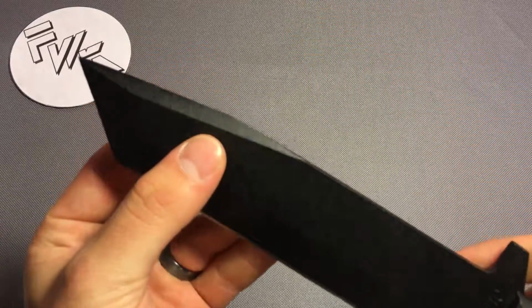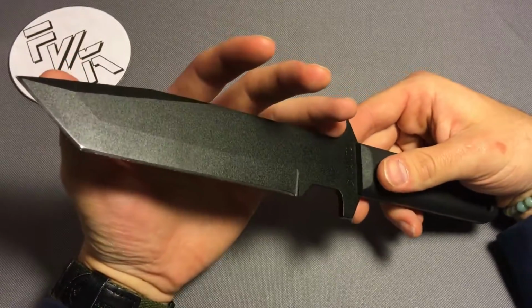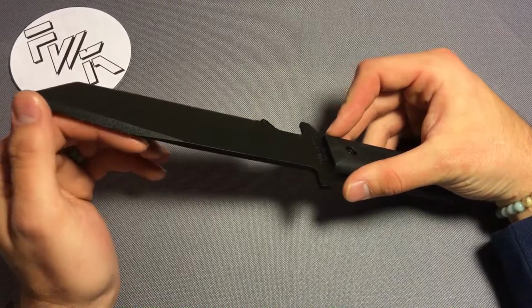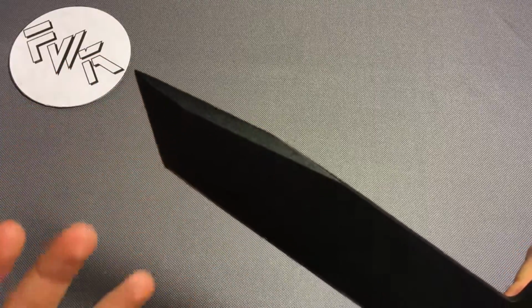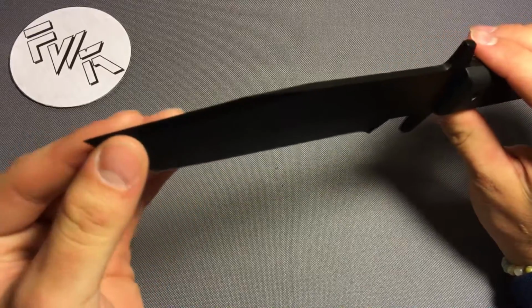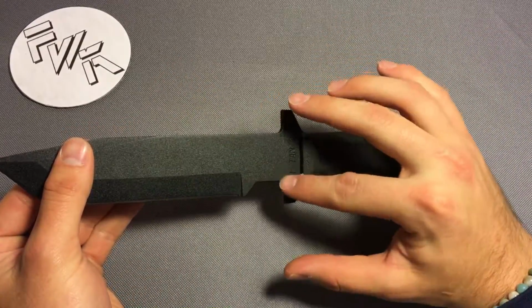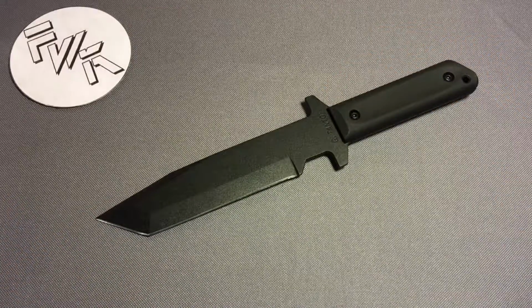And I might sharpen this top swedge or add serrations to it or do something to it, because with 1055 not holding an edge very well, and this being a knife that you would trust your life to if you had to use your bug out bag, I guess, this thing is about at an edge already, so I think I could add an edge to that, get a little bit more cutting edge to use if I did have to process some wood or whatever. I might even increase its penetrating ability, even though this thing is a beast at penetrating with that aggressive Tanto. So maybe I'll round out the finger choil too. I haven't quite decided. So I'm going to get on that probably this weekend, do some modifications to it.